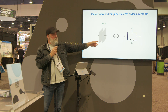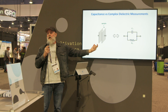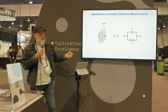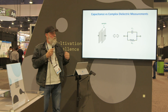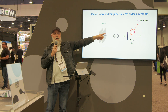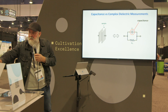This is the only technical slide you will see. It shows that some material between a pair of electrodes is represented as the capacitance and the resistance in parallel. The capacitance accounts for how much water is in this porous material, and the resistance or conductance accounts for how salty, how conductive the material is. The most traditional technique using moisture sensors is known as capacitance measurements, but that is very difficult to do. I wrote a paper that explains the problem in some detail.